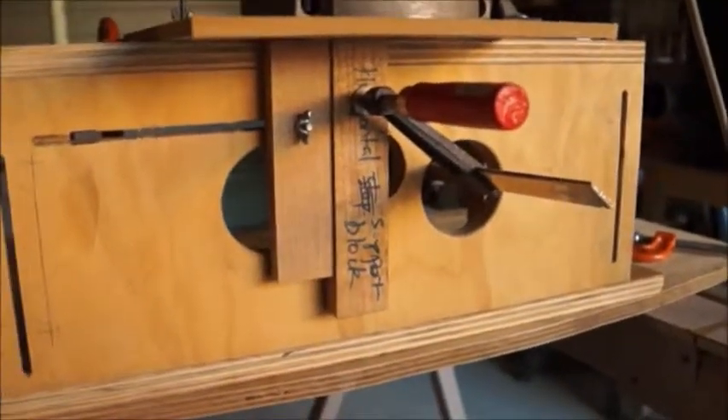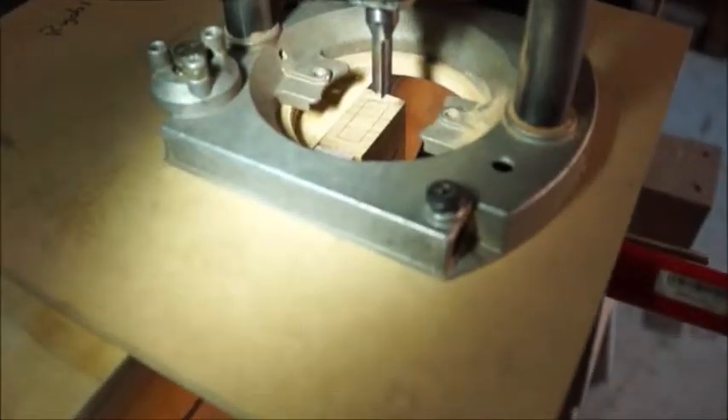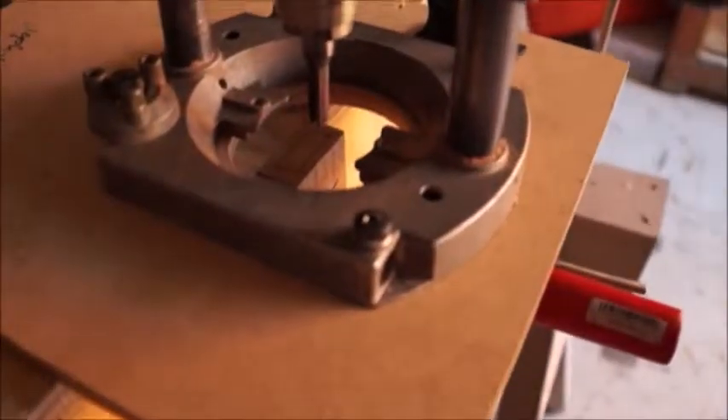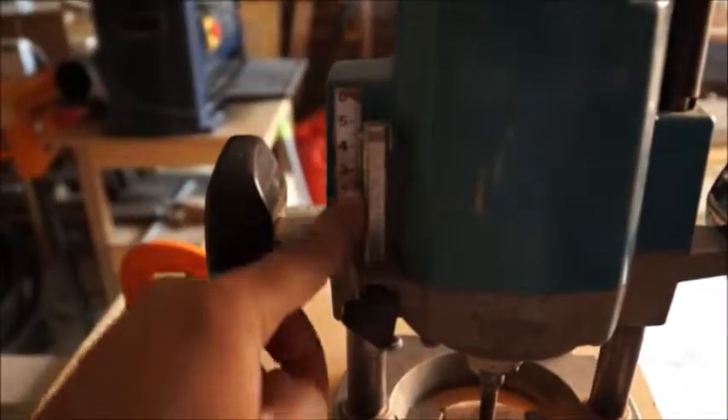The first thing I do is clamp the piece that's going to be cut. The piece to the right is the one in which the mortise is going to be made. This is just the stop block that we're going to use as a guide for multiple cuts. You can see the mortise has been marked, and using this marking I set up the router. The router base plate can be moved forward or back depending on where we want to make the mortise. We set up the two stops based on the markings, and then it's just a question of actually making the mortise. Of course you want to use the depth gauge on your router to make sure you get the correct depth.